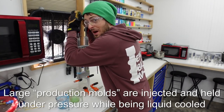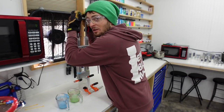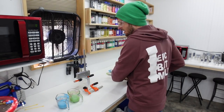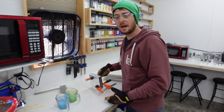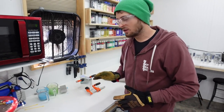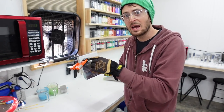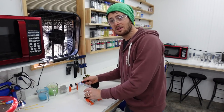Hold pressure for about 8 to 10 seconds just to make sure there's no denting. In the industrial process, these are held under a lot of pressure while the mold is cooled, resulting in a fuller finished bait. After 10 seconds, pull it off and shoot the extra. Throw a little extra in the sprue. I actually spaced from the top of the mold to the first bait - it's one inch to the top of the gate with a quarter-inch diameter sprue, so it's very unlikely it's going to suck down into the cavities.